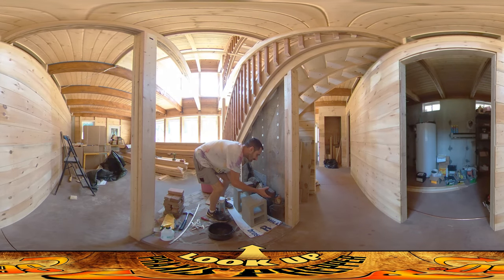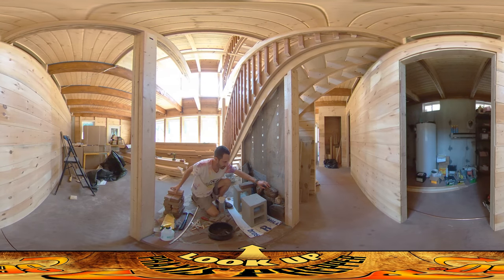This is going to set right in, and the important thing is to try to make the face roughly flush with how far out the other faces are — because some of these are thicker, some are thinner — and that looks pretty good to me. Before I put the brick to retain it, I just want to push in here and get the cement. I don't care if this looks beautiful on the front; I'll be coming back later to fill in all these cracks. I just want this concrete to be up and in contact with the stone above so it actually sticks in there.